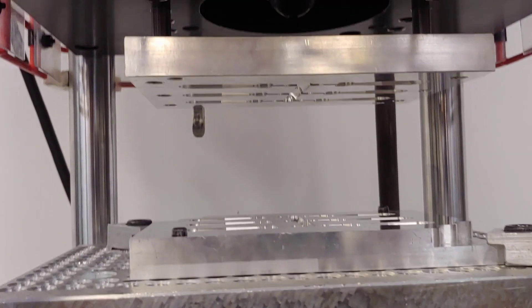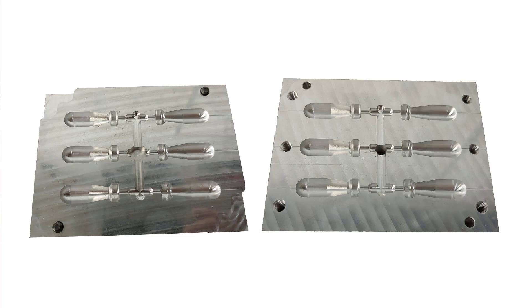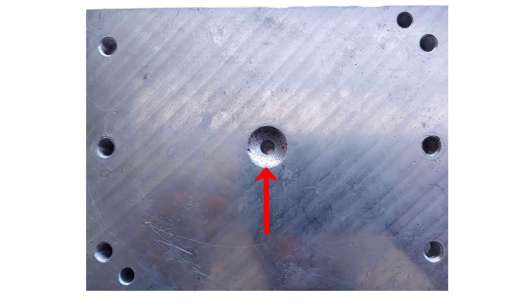This is the mold we will be using. It is a multi-part mold with six cavities to make six handles per properly executed injection event. Note the alignment pins in the mold — these pins ensure that the mold bottom and top align correctly when clamped. The runners distribute the material to each mold cavity from the sprue, which is located on the top half of the mold. This is where the nozzle will inject the thermoplastic into the mold.